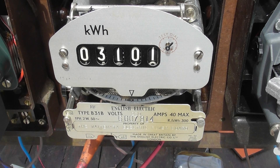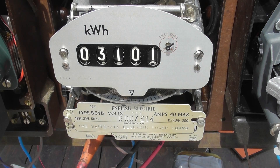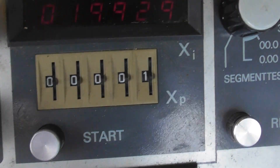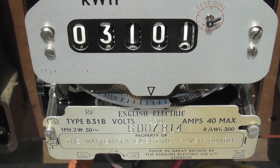More or less spot on for a 70-year-old meter — very good. The target for this meter is 20,000 pulses. We'll start. Ten revolutions, so it takes a bit longer. One, two... First reading is 19,929. That's pretty close — it was running a little bit fast, a tiny bit.